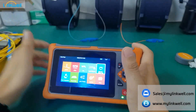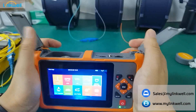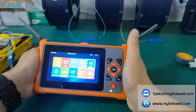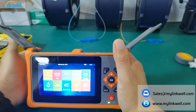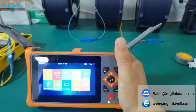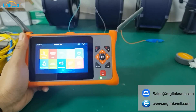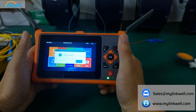The sixth function is about the fiber inspector. I have the fiber inspector and the connector with this OTDR. It is like you can detect the connector performance — whether it is clean or not, whether it has a scratch or not. In this case, you can understand the performance and decide whether you should clean or replace the connector. We have explained this in our previous videos about our other OTDRs, so you can check those videos on our YouTube channel.